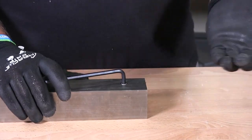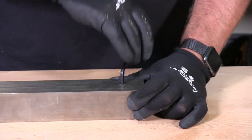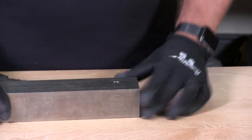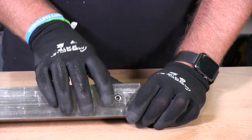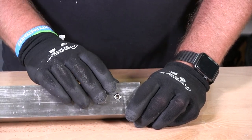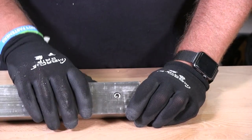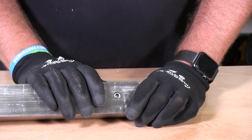Because if you could have a head, then it'd be fine to use a regular bolt — that's why set screws are used in these applications. When I tighten it, you can see that it's either flush with the top of the material, or it's a little bit countersunk from the top of the material so nothing can hit it. So if it's on a wheel turning, it doesn't interfere with the operation of the application.